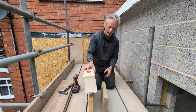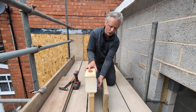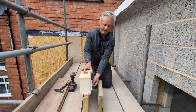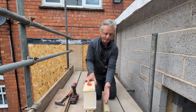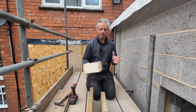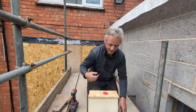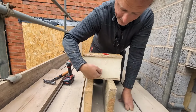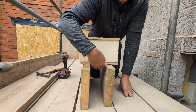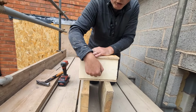So we like to find our rafters, thus giving it a better chance of that heat, that energy coming up through that moisture, coming through and not being able to get through the vapor barrier, because in theory, where that vapor barrier spans the rafters, it's untouched, there's no holes through it, thus being as thermally efficient as it can possibly be. Now, if you didn't do it, the top of that screw is around about there, so you've got metal there, obviously, through the screw. The heat comes up, it hits that metal, it travels through, and then it gets to around about, for argument's sake, around about there. That is where the warm air will meet the cold air.